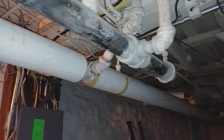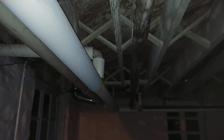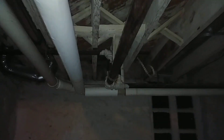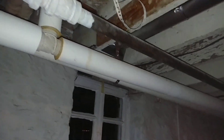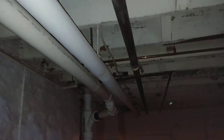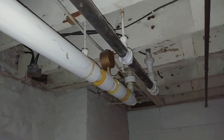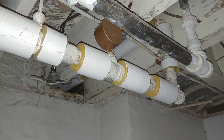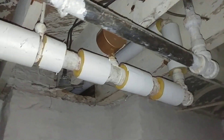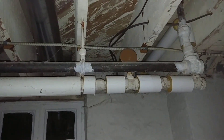One pipe is left uninsulated. When you have two pipes both the same size, generally what you're looking at is a gravity hot water system, because the only moving part was the water — they hadn't developed the circulator yet, and wouldn't for decades. The pipes have gotten smaller over time, but these are both the same size. Wait a minute — that's a Gorton number two steam vent on the insulated pipe. What the heck's going on? Let's go back to the boiler.